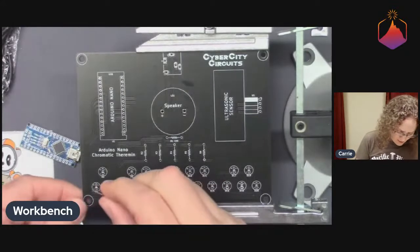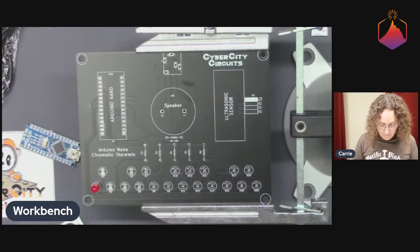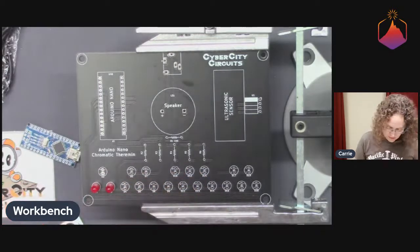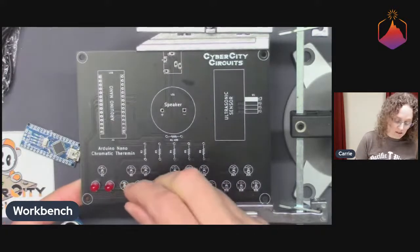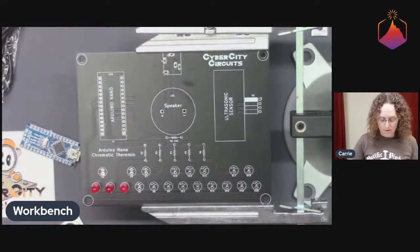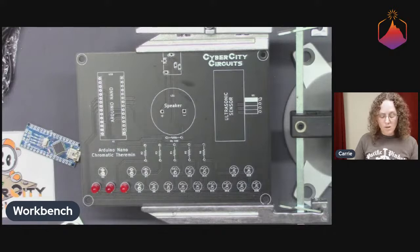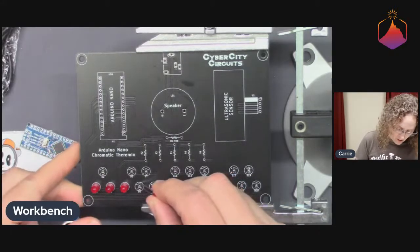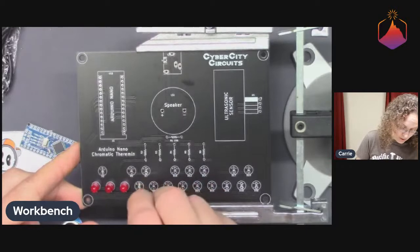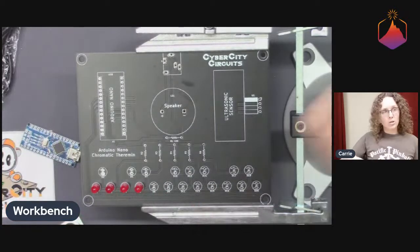All right. A theremin is a musical instrument that is basically made of two antennas, and one you use to control volume and one is used to control pitch. It relies on the fact that your body is a giant capacitor. As you physically move closer to the theremin, you'll either change pitch, if you're moving close to the pitch antenna, which is generally an upright one, or you'll change volume, which is generally a loop antenna that's off to the side.